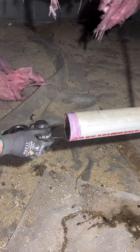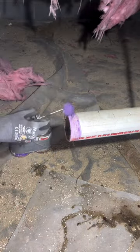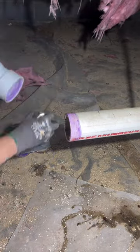So that's what I just cut out, and now I'm just tying the line back into itself. I'll be adding a cleanout right here because this is towards the end of the main line in the crawl space.